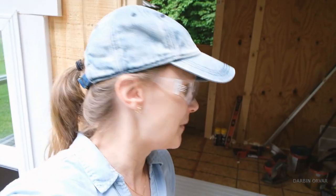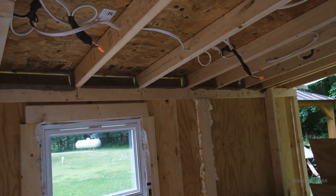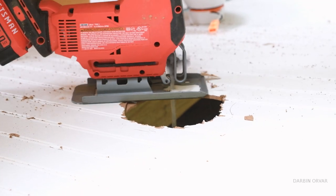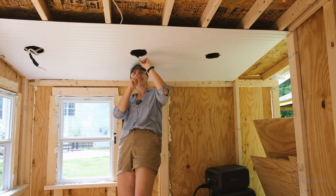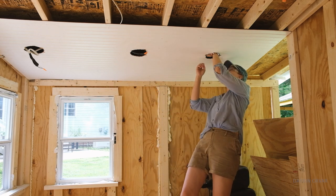Working on putting the beadboard up. The tricky thing is we have these lights coming down, so we need to mark out where the lights are going and cut holes so they can fit through. One thing that's good about beadboard is you already have the ridges or the design. So we measure out — this is the first piece going right up there. We got it up, got the holes here, so I just need to find the wire. The light will go right on here.